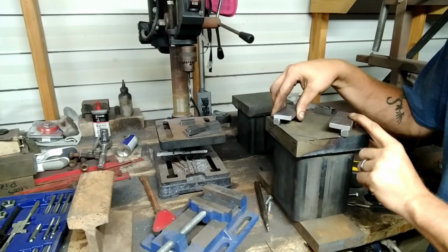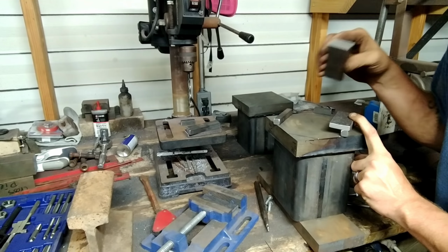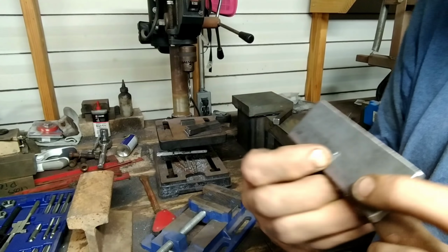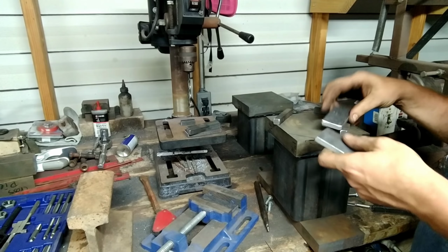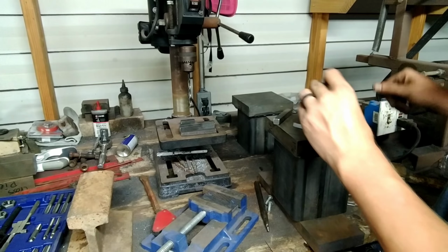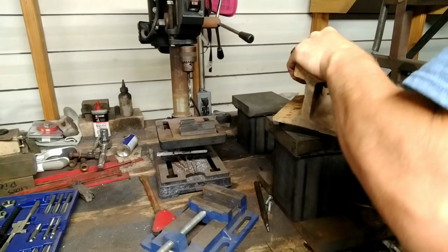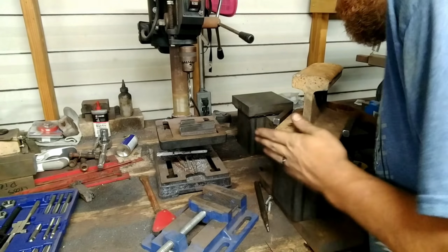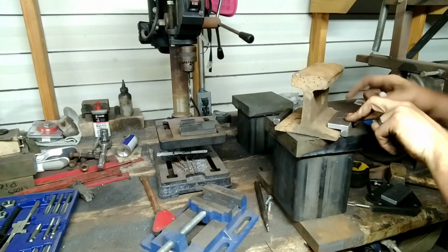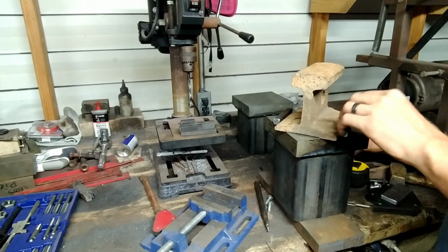That way I can just use what I know I've got, this 1/2-inch plate, and that could be the base for my dies. And then I can put tool steel on them for the dies. But the 1/2-inch plate could be the part that slides in there. But not only are we going to do that, we've got them center punched here, you see. We're going to drill holes in all 4 of them, because I've got 2 sets of these, one for each side, of course. We're going to drill holes in them and tap them to fit these bolts. That way I can tighten that bolt down. Essentially, this sits in here like that. This is on top of that. Right there. I can just crank that bolt down, tighten it in place so it doesn't move. Hit them on both sides. I'm going to put 4 bolts in it. May not need all 4, but I'm going to put them in there anyways.